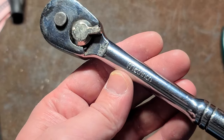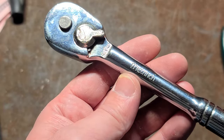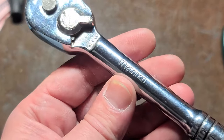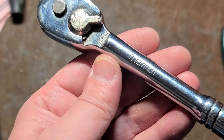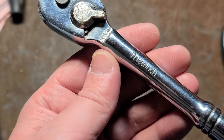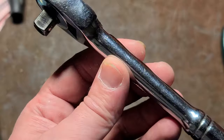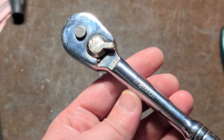Other sizes, such as 3/8ths or 10 millimeter, are not interchangeable, because 3/8ths of an inch is 9.5 millimeter. Metrench tries to make tools that fit both sizes, but in the case of 10 millimeter or 3/8ths, their wrench is going to have to be big enough to fit a 10 millimeter bolt head — you're not putting a square peg in a round hole. So it only grabs onto the very tips of the corners of 3/8ths, and that's always been the negative comments about Metrench. It's just that fact.